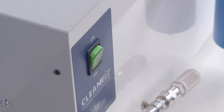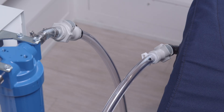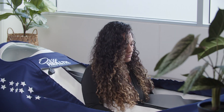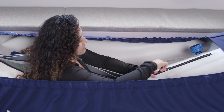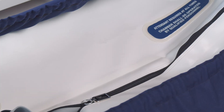Entering the chamber and zipper closure for self-use. Make sure the compressor is on and the air hose is attached to the compressor and to the chamber. You will be stepping into the chamber from the top zipper opening, then sitting down facing the end of the chamber. Start by zipping the interior zipper partially, then partially zip the top as well over the gray flaps, tucking and smoothing them between the zippers as you go. Once you get them both closed about a quarter of the way, you can proceed from inside.